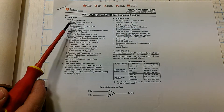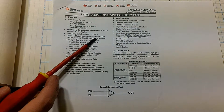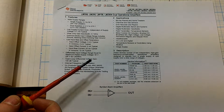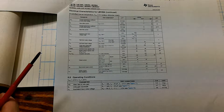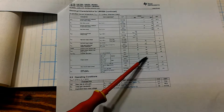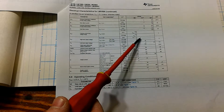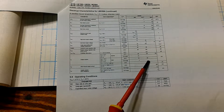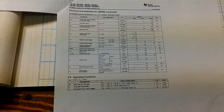The device can operate up to 0.7 megahertz, which is equivalent to 700 kilohertz. The typical output current at 25°C is about 30 milliamps, which is good enough to turn on a transistor or a gate driver to actually drive a power transistor.